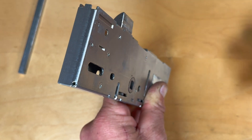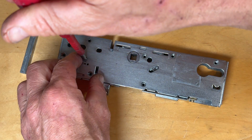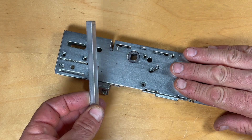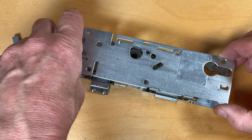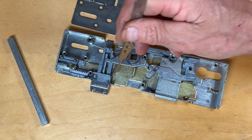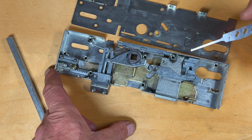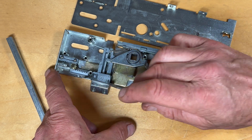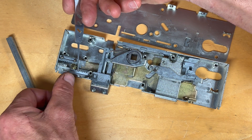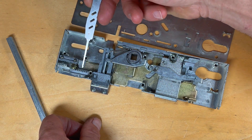That's what the split spindle is all about. Let's have a look inside this centre case — I've taken most of the screws out and left two in. What we've got inside here is what allows it to work in a lift lever or split spindle kind of way. If we take that cap off, this gold-coloured part here is called the strap, and it's the entire strap that moves up and down, which operates the multi-point mechanism inside your door. The bottom half would be sleeved over here and the top half over there.